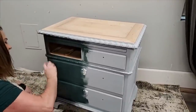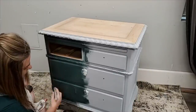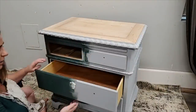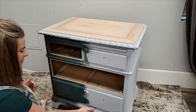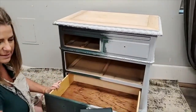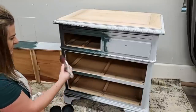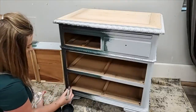I'm going to do the same thing on the other side and get my basic colors figured out, then take these out and paint around the door frame. I'm only working this half right now. I'm spraying water — just water from my tap. I'll pull these guys out. Now that I have an idea of what my color layout looks like on the drawers, I'll work on these outside of the frame. On this style of dresser, if I keep painting them in the frame I keep getting a line.